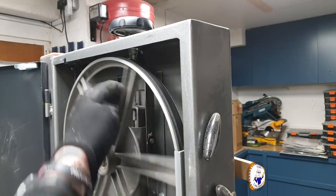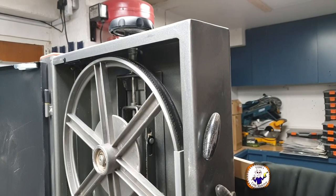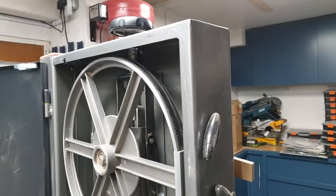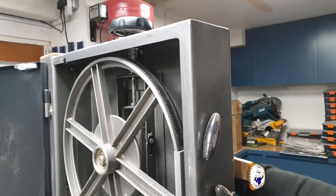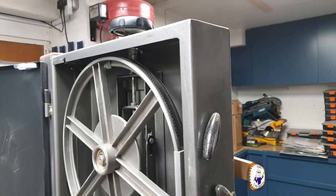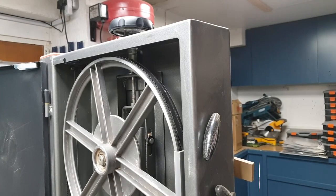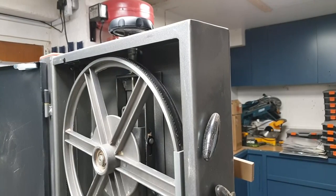After applying final tension I can see I've changed the tension and the blade is now further forwards, so I'll adjust the tracking again. I want it to go a bit further back. Repeat this process until you get the blade in the right position and at the right tension. Once I'm happy with that, lock it up, give it one more spin — we're good to go.